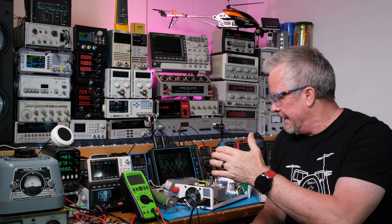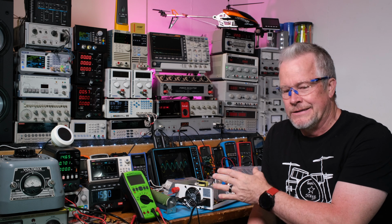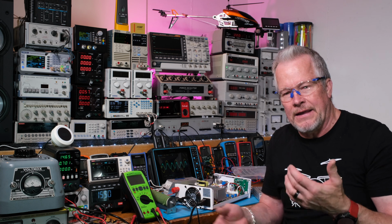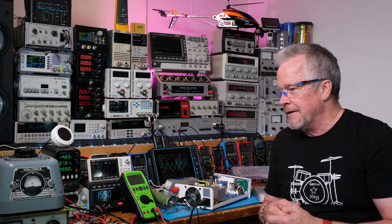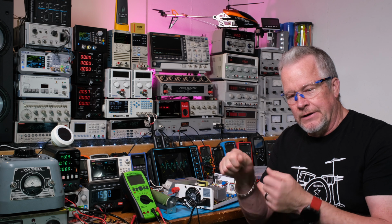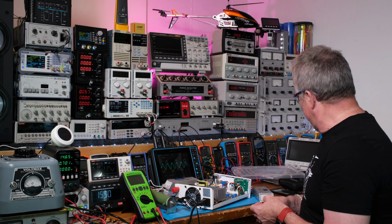By the way, I like to let the fan turn itself off before I turn off the power, because I don't want everything staying hot and cooling with stagnant air. I don't know if you've used one of those overhead projectors. They operate on that method automatically: you turn off the power, the fan stays on until it cools it down and turns itself off. When you're running this kind of thing on your bench, same thing. Once you're done running power, leave it running for a while. You can turn down the voltage and current, but just leave the fan running and let things cool down.